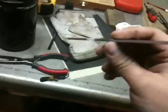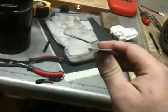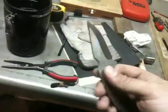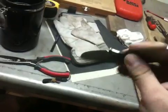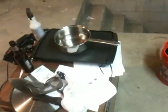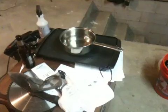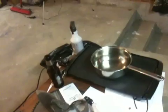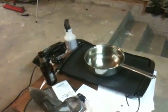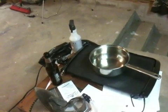It definitely depends on the original thickness of the stock — if you use a sixteenth-inch piece of stock, the thickness of a dime would be too thick. You just want to ensure it cools evenly and that no one part is too thin, because you will get a little bit of twisting, warping, or cracking. Another way to help with this is to preheat your oil. I usually heat it to about 120 to 150°F, because quenching at room temperature — especially when my shop is around 55°F — is definitely too cold. Preheating the oil yields a harder quench and more consistency overall.